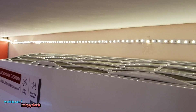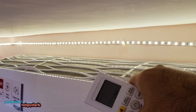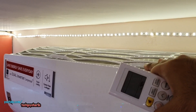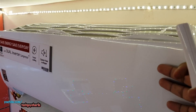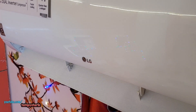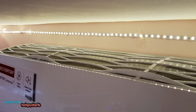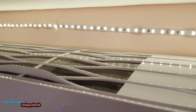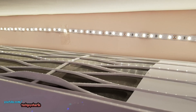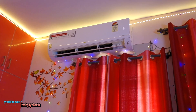A clean filter and energy saving might not seem related at first, but if the filter gets clogged with dust, that will reduce the airflow and your compressor will have to work even harder to cool the room. If there is not enough airflow through the indoor unit, the AC will not be able to keep up on hot summer days, and the compressor will work harder, increasing your energy bill. So make sure you clean the indoor unit's air filter.